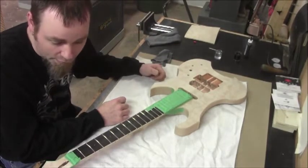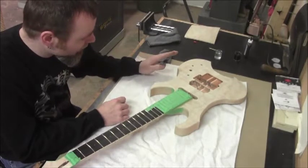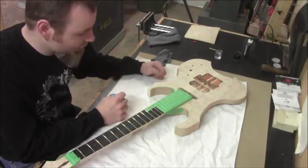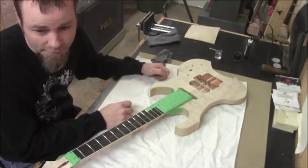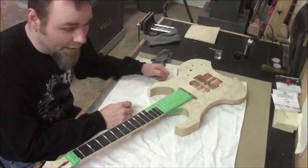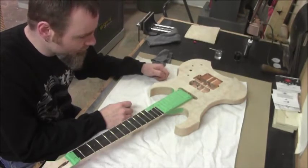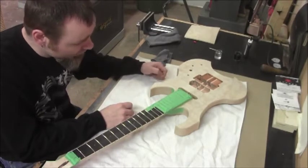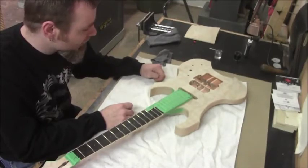What we'll be left with is just the dark stain in the end grain parts. You do a couple of coats of that, get that nice and dark, and then you go over the entire thing with your color. It enhances the grain — pops it, as some people call it — gives it a really nice effect, a really deep contrast between black and whatever your color is going to be. In this case it's going to be red, so it'll be a nice red and black kind of wavy surface.